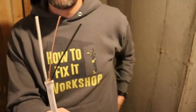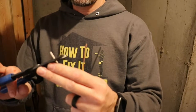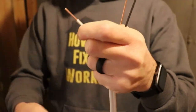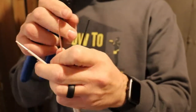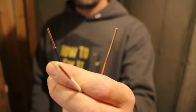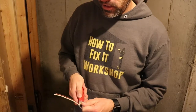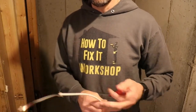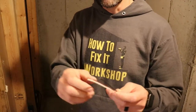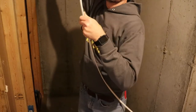I'm going to use my pliers to peel back the coating on those two wires to expose the bare wire underneath. Nothing is connected, nothing is hot at this point. With this being a 14-gauge wire, I'm going to use my pliers at that 14-gauge mark and strip back about an inch or so of bare wire — just like that. I'll go ahead and do that to both ends of the wire. You wouldn't necessarily do this before the wire is installed and attached to your structure, but since this is such a short run I'm doing it down here. Normally you'd attach it to the joist, have it tacked and stapled in place, run through your fixture, and then strip the cable ends after that.